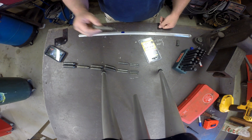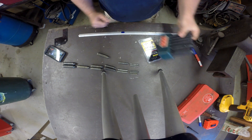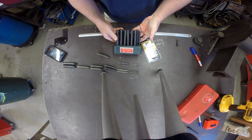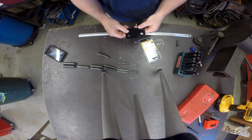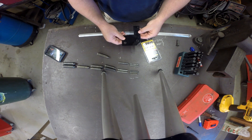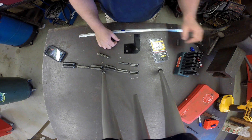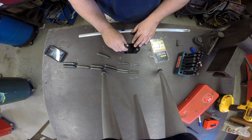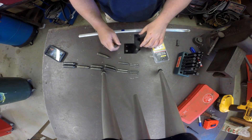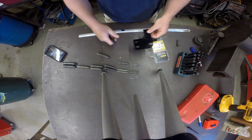Before we take a look at these, I'd like to show you a couple of other things — maybe you're already aware of them, maybe you're not. What I've got here is a set of transfer punches. A lot of you have probably seen these and know how they work. If you've got a part like this and you want to match it up to something else — let's pretend the top of this workbench is a part you want to bolt this to — you can find the appropriately sized transfer punch, place it in each of these holes, give it a little smack with your hammer, and it gives you a perfect bolt pattern to locate the part on.